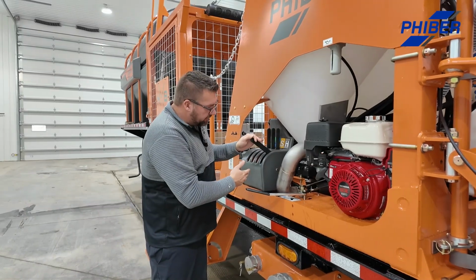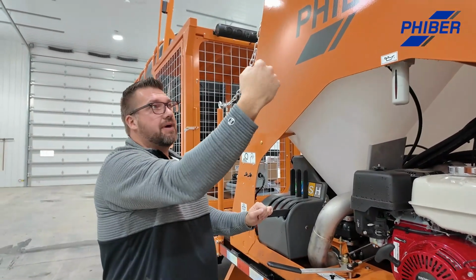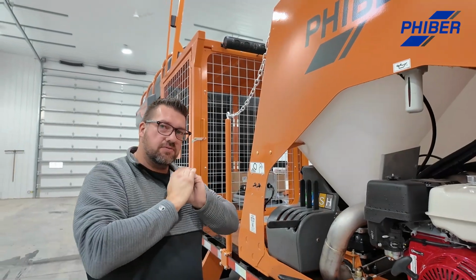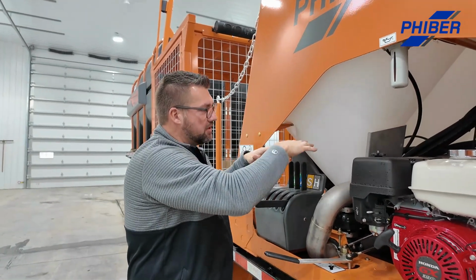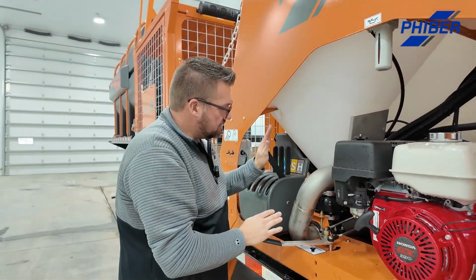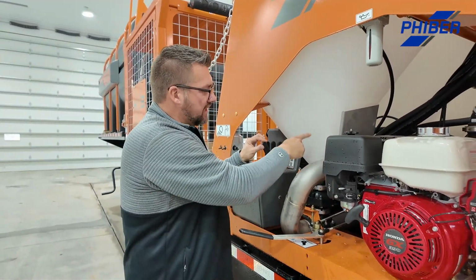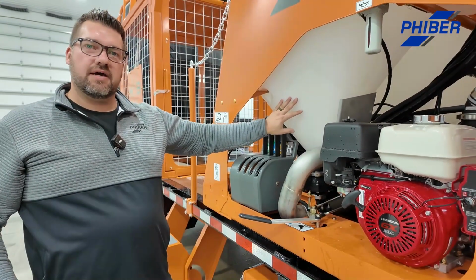As I pull the handle further, it opens a second valve. So that rinse nozzle that I talked about in the back of the inductor that's hidden there, it's a special one we've designed that washes the walls of the inductor down. So as the chemical's unloading, it's chasing it down with fresh water. Now I'm empty, I shut this off, it shuts my rinser off first, I can suck that last little bit of rinse water out, I'm left with a clean, empty inductor every time.